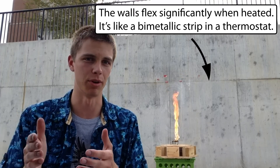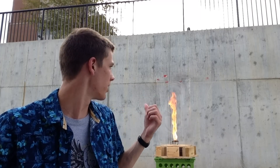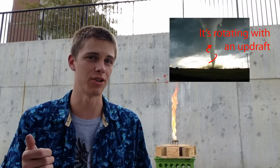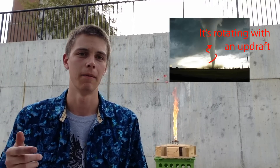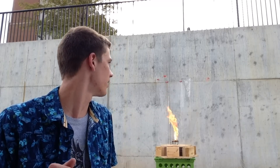This went through lots of iterations. There are ways to do it with fans and powered blowers, but what I ended up with is actually a completely passive design. It was a combination of things I found through prototyping and videos I watched, so I'll link a couple of those in the description. But to make a fire tornado like this — it's really a fire vortex — you need to understand how a vortex forms. Just like a real tornado in storms, it's got two elements: rotation and an updraft. Both of those are necessary to form a vortex.